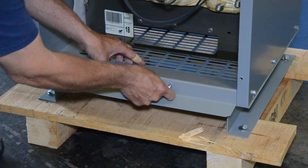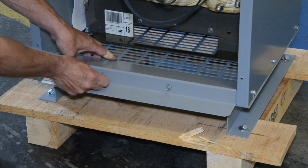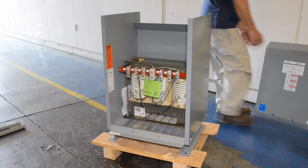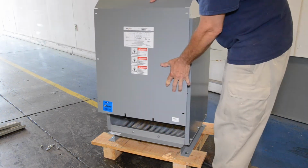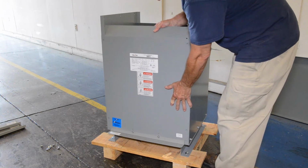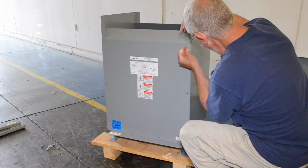and back panel. For Weather Shield Kit WS16, loosely reinstall a self-tapping screw into the second hole from the top in the right and left side flanges. The front and rear panels can be hung and supported on these 2 screws during the replacement process. Tighten all the screws when both the front and back panels are installed. The bottom weather shields are held in place by the front and rear panels on the transformer.